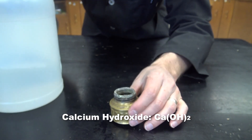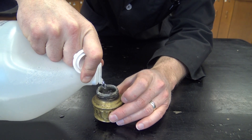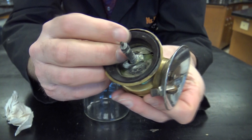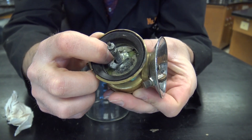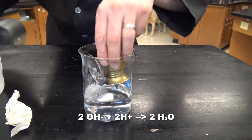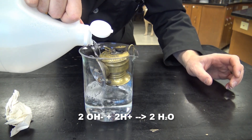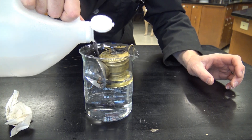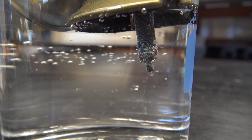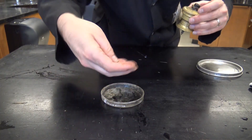What we don't want is for it to blow up. When I got the lamp from Grandma, it didn't work — it was plugged up. So I decided to take all the parts and pieces and soak them in some vinegar. The vinegar reacts — you can see the net ionic equation for those of you that care — essentially combining with the calcium hydroxide to make water, dissolving all those chunks.